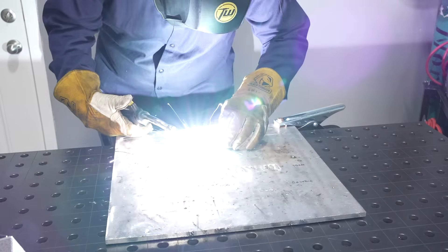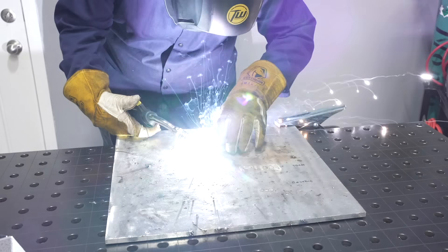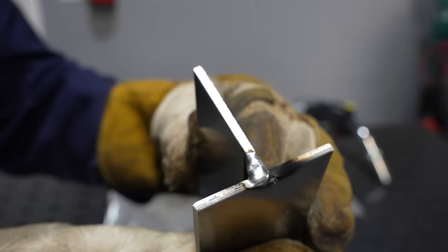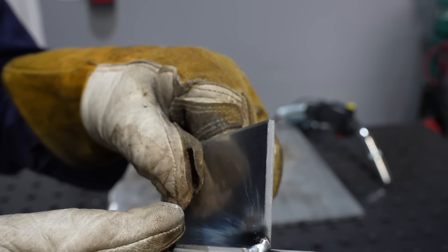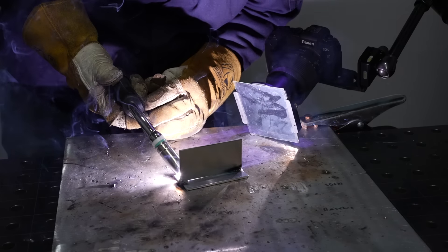That's very challenging when you're welding a project with a lot of different thicknesses or joint geometries, because each time you have to dial in your settings. Once you do, you can cover a lot of ground quickly — but TIG welding with the foot pedal and the ability to change how fast you add filler metal lets you adapt on the fly. With aluminum MIG you've got to be quick on the trigger for a tack weld; you add material in a hurry and you'll get slightly larger tacks than with TIG welding.